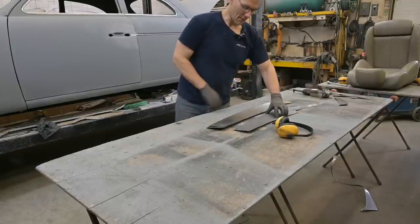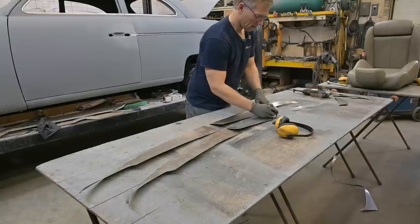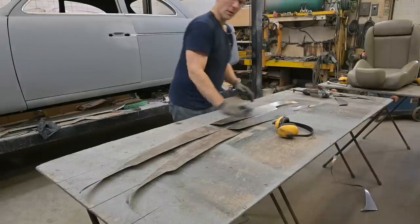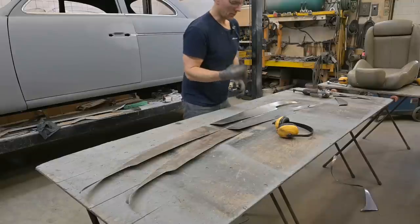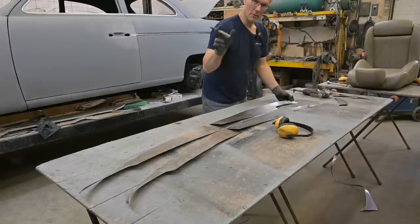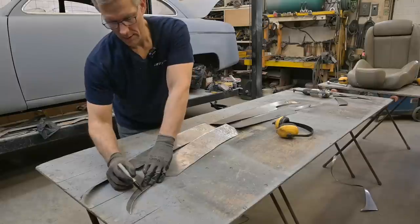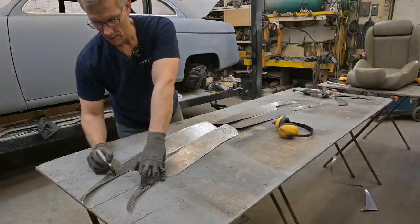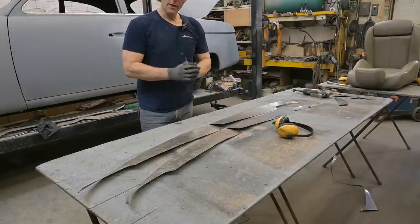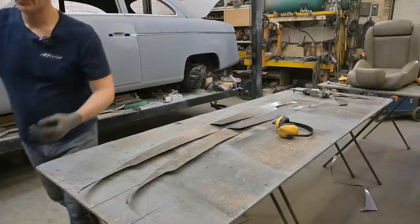We should start indicating what's top and what's bottom. That's gonna be the top, passenger side. Let's put it out here. Top, passenger side. When I wheel this, I don't want this transferring to my upper anvil. Believe it or not, yes, your Sharpie will transfer onto your anvils. Passenger side. This is top, driver's side. That's bottom, driver's side. And first thing we're gonna do is throw the rubber wheel in there and pray that it does some shaping for us. I've done it before, I know it will, so here we go.